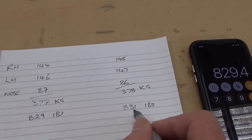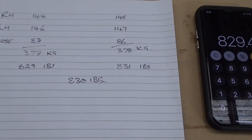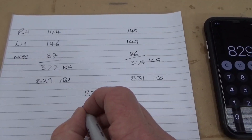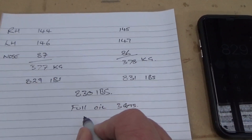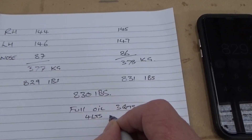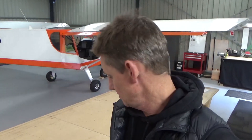So in between that — 829, 831 — let's call it 830 pounds, the aircraft weight. Now that's with full oil, which is three quarts in a Jabiru, and I've got about four litres of unusable fuel. That gave me a total of 830 pounds. I've got a three and a half litre header tank which is, in my case, unusable, plus whatever's in the hoses. So my aircraft: painted, spats, carpet, Jabiru 3300, ready to fly — 830 pounds, or 377.5 kilos. Thanks for watching.